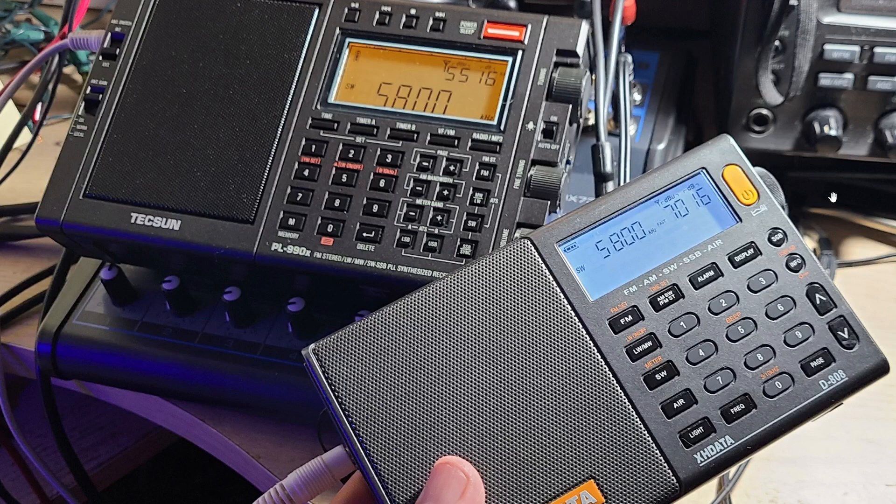Overloading is not a serious issue today. If we were using these radios in the 70s or 80s when signals were everywhere, it would be a much bigger problem. I've seen it occasionally on the 49-meter and 19-meter bands — for example, WRMI on 15770 mixing with WWCR on 15825. You generally need really powerful shortwave signals nearby for it to happen. If you live where shortwave signals are weak, you have zero reason to worry about overload — use as long a wire as you want.